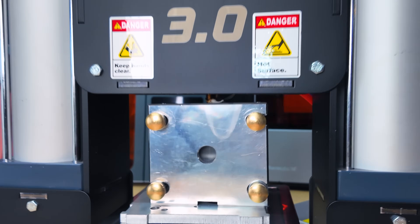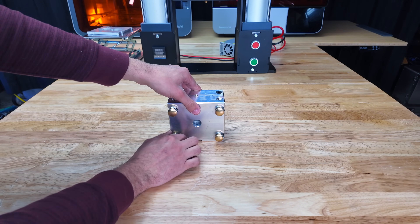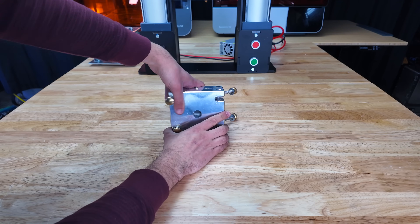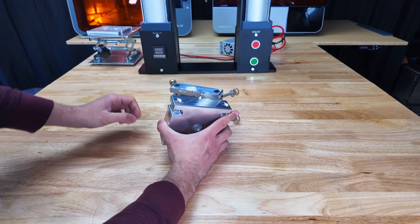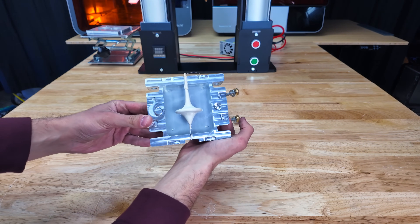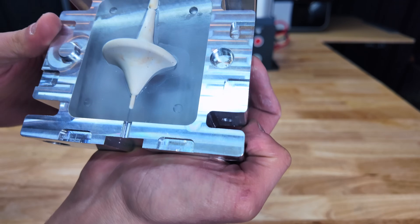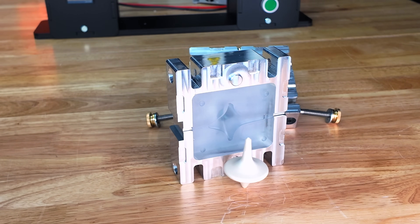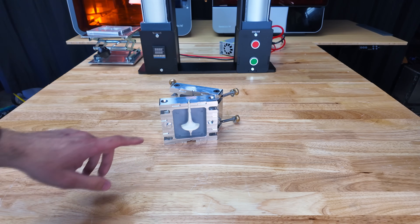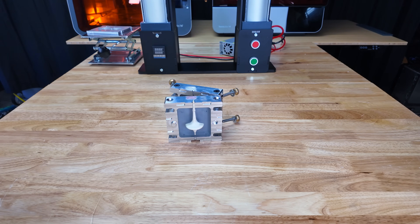What I like about the clear molds is that you can actually see the mold fill through the little hole during injection. Our injection is done — opening up the molds by undoing the thumb screws and opening the latches reveals an awesome result. There is a tiny bit of deformation on the outsides of the cavity. In an upcoming video releasing in about a week we'll compare different materials used for injection and see how this resin compares to other Formlabs options as well as cheaper FDM alternatives.